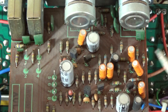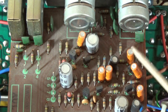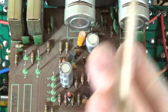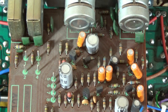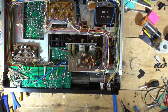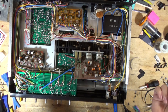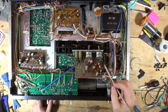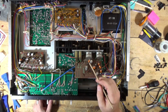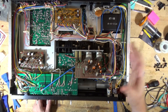At a minimum on this, I'm going to replace the bad transistors and then clean the pots. I could certainly recap this entire board, and the 737 is kind of on the cusp — on the edge of the value of a receiver that you might want to completely recap, because you might get your money back on this if you're going to resell it. This is for one of the shops, so we get into the financials from a resale perspective.